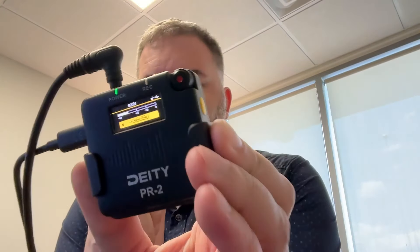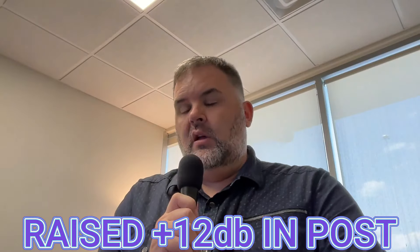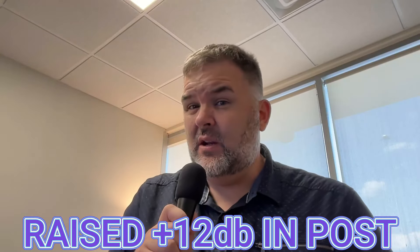Let's continue some tests elsewhere. Here we are using the Deity as an audio interface plugged right into my computer using OBS. If I wanted to put a dynamic microphone into this and run it through, I could — and I will. I've got a dynamic microphone plugged into the Deity, which is currently on 36dBu of gain — the top of its range — which gets me about -10dB in OBS. My office is pretty noisy, but I'll be quiet so you can hear any hiss from the preamp.